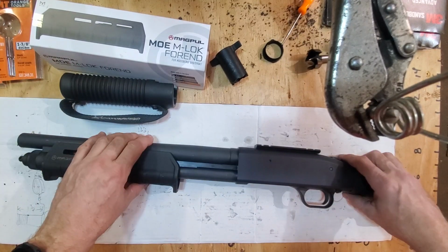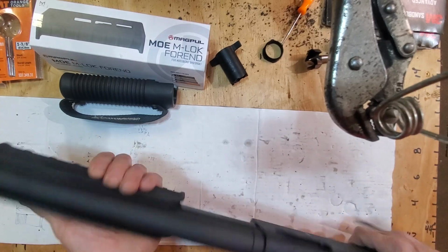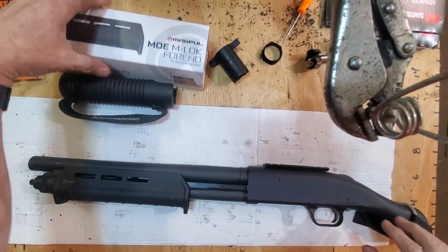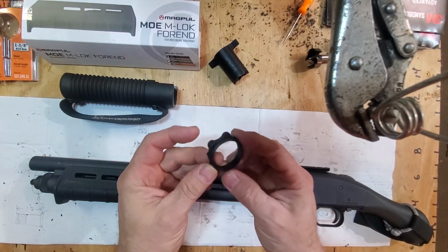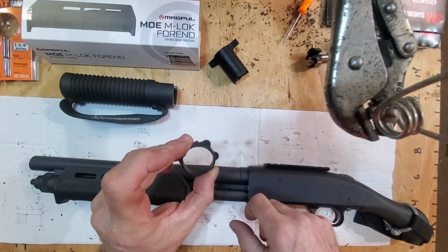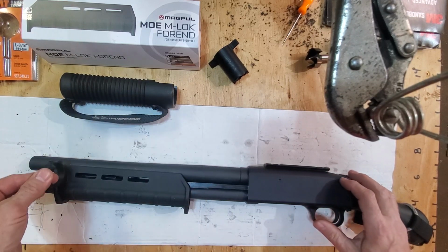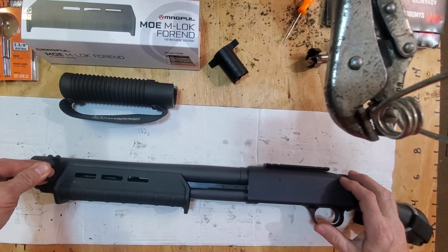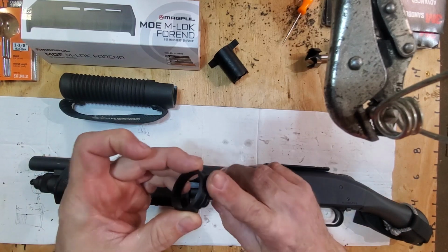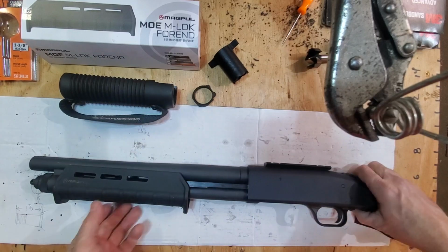And there are some other little changes, like the barrel is tapered more, so that if you try to use this bushing that has a stabilizer on it, the little stabilizer ears on top that are meant to ride up and support the barrel in the forward position, that also will not work because there's so much of a taper on the barrel right here.